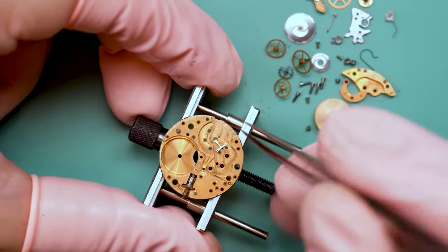I have never actually had to deal with this before, but I looked it up online and made a little setup. I took one of my old baskets and filed it down flat because I didn't have a piece of brass. I also don't have a spirit lamp, so I'm using a lighter. What you do is heat up that piece of brass, then set the part on it to transfer the heat to the shellac inside. You can see a piece of shellac sitting there — it's just that brown stick. When the heat gets hot enough, you can push it through. This is a re-shellacked impulse jewel — it's not perfect, but it's much, much better than it was before.